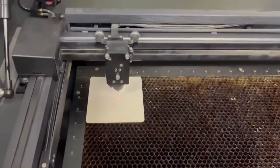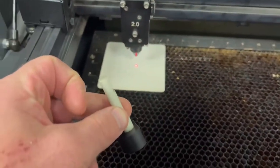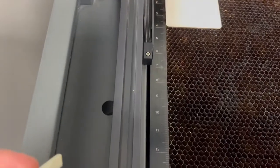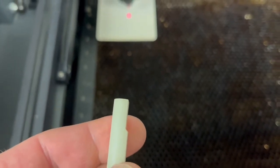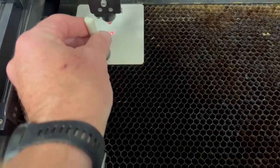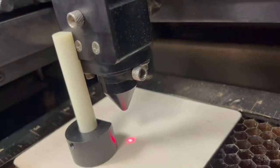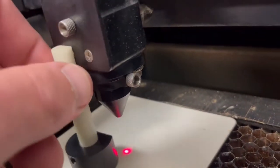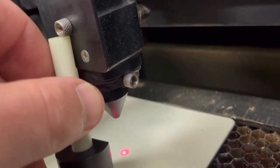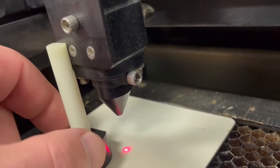So now once our laser head, or our lens, is over the piece of plywood, we have our Z0 tool, which is usually stored right here. So we pull that out, and if we look really close on there, we see that there's a little bit of an angled notch on there. And that little angled notch is going to rest underneath that lip right there. And when we position this, we want to make sure that we aren't putting this underneath that screw there, because if we bottom that out, we can damage that screw and our Z zeroing tool.